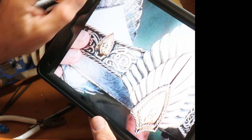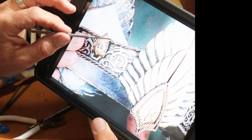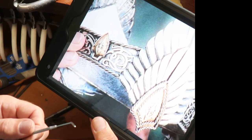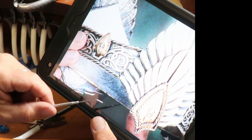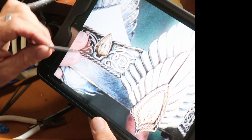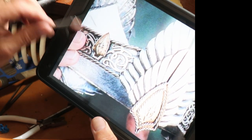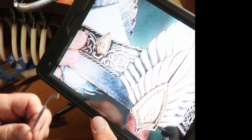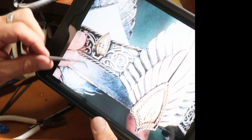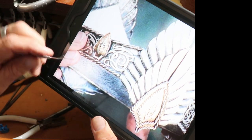Once it came back, of course, this is all finished in copper, sent to the platers, hard plated in fine silver. And when it came back, brand new shiny looking — which is something I'll touch on in the breakdown video. Basically we had to antique it. That was a process of immersing it in a solution containing, amongst other things, some sulfur, which very quickly blackened the silver, and then we buffed up the highlights. That in itself was almost an entire day's work, just getting it to the right tone for what we needed.